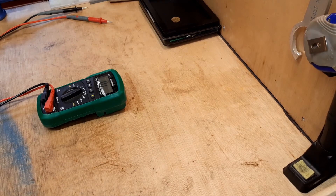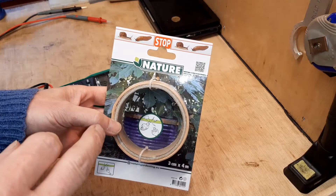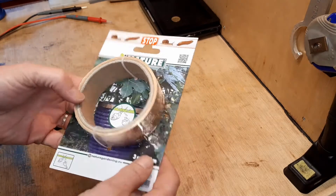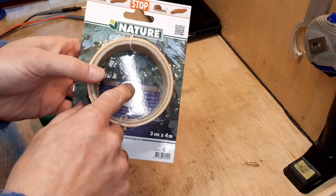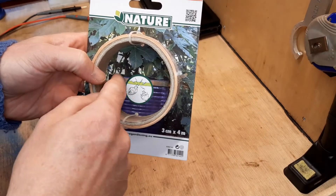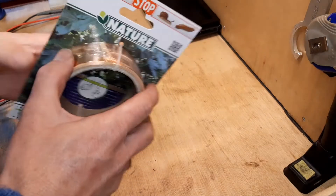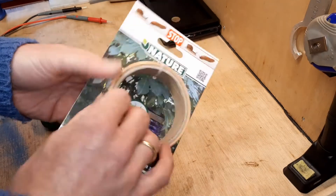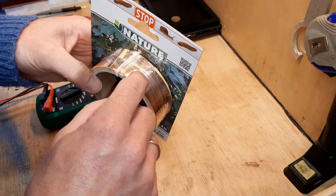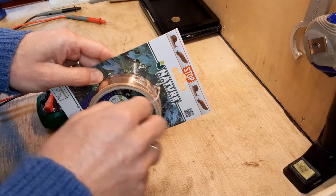So I googled for copper tape, and little did I know that existed. What I also didn't know is that it's even used to repel snails — you can stick it to your pots in the garden. There's this blue pot with a stripe of tape around the top edge, and apparently it repels snails. But it's red copper, and I'm pretty sure I can solder to this and stick it to the circuit board. So I hope I can create new pads out of this.